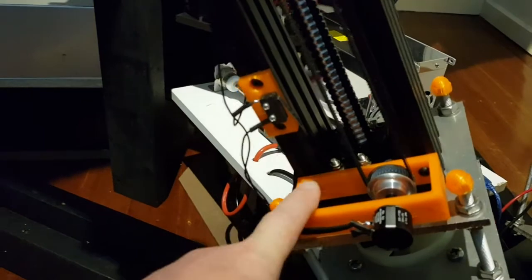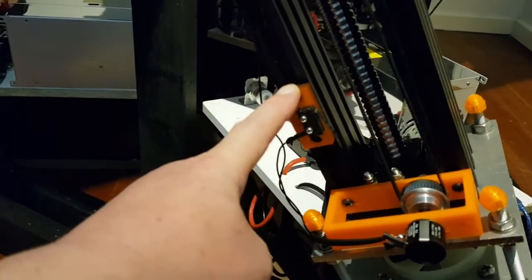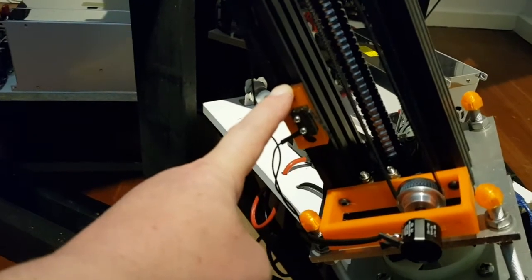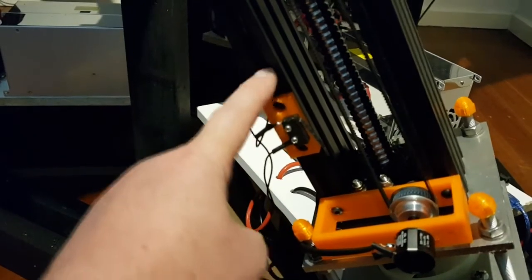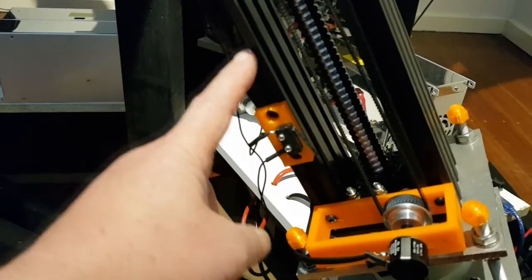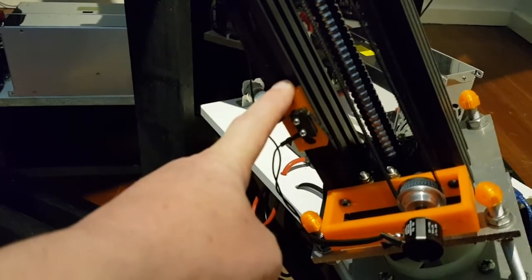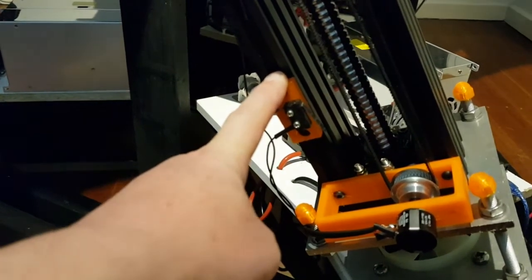The downside with this is that the limit switch will limit the travel of the actuator rod. So if you have them closer together, if I move this up here, it'll be a lot safer, but there won't be as much travel on the motion platforms. So there is a trade-off with the position of the limit switch, and I'll speak more about the limit switches later.